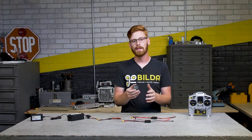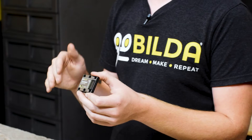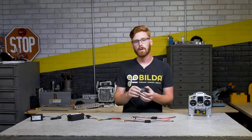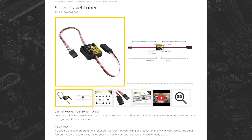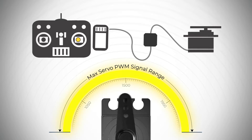The PWM signal range may be slightly narrower than you're used to for driving servos. This range was chosen so that most hobby servos rotate exactly 90 degrees on the signal range, which is about what you need for most RC applications. But it's probably narrower than you're used to in FTC, so if you plug in your servos and they don't rotate as far, that's why. You may need to look at a servo travel tuner if you need to increase that range for your prototype.